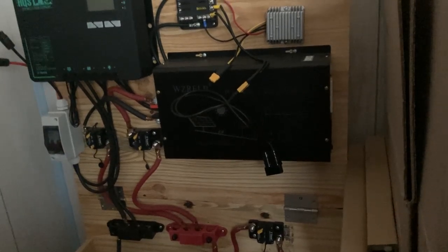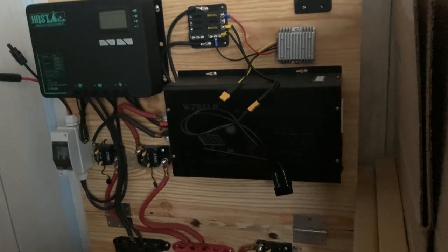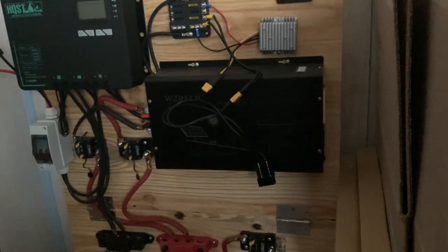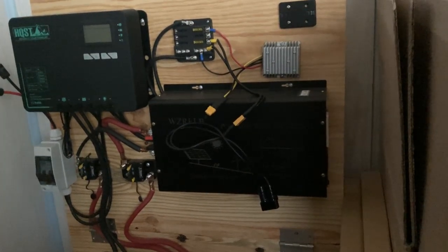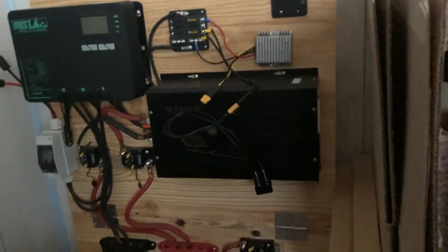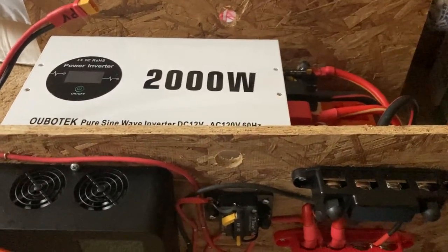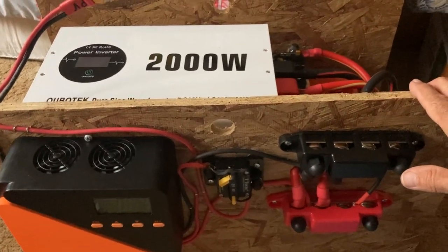This is going to be running in the house, probably in the garage. I want a little bit nicer everything. That's two-gauge wire - it's 24-volt, two-gauge. I probably can run this 3000-watt inverter, but the wire should maybe be a little bit thicker. That being said, it's 24-volt running probably just 1000 watts max, so those wires are plenty for what I want to use this box for. Now that I've got that box with 1200 watts of solar, I've got this box too - four 100-watt panels plus my portable 300-watt panels. Built this for the solar chuck wagon, so if you lose power I can just set this up with a 370-watt panel.